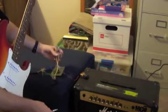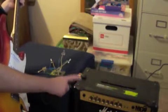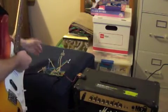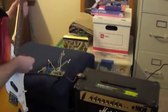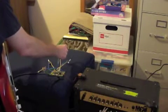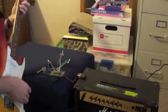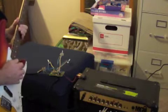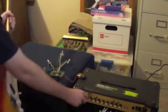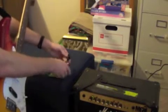The potentiometer, the A100K, and the right one, the B10K, are, when it's doing the pulse wave, your high and your low sets, and the left one, the B100K, is the rate or the frequency, as you can probably hear. So yeah, this could take a bit of debugging to get it to work right, but by no means am I a professional at soldering and all that, so it could just be my job.